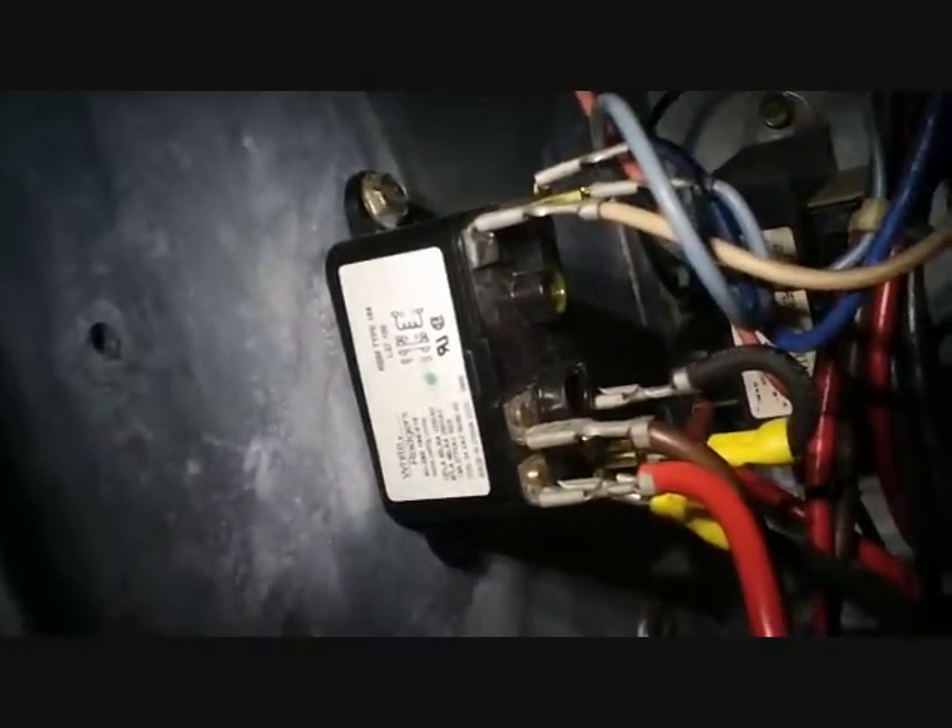You see our little jumper — that jumps power across. And you see a brown that comes from the sequencer, so if the sequencer is energized it sends a signal here, and if the fan is de-energized — meaning it's not calling — it will still receive the proper voltage to run as a safety precaution. That red wire at the very bottom is your other line of power; that will complete whenever it's calling for fan, send power to the fan and start it up. That is our new relay.